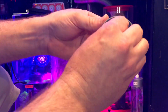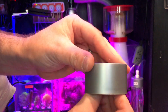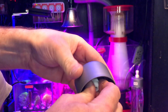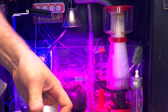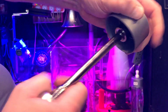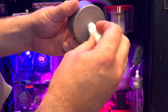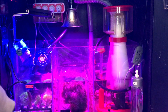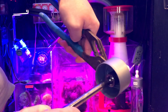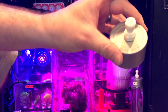I put the male end in here on the inside — it can be a little tricky; sometimes you have to work it in there because I didn't use the exact size drill bit. Then I use a 17mm socket to push it the rest of the way through. Take the female end and put it on the top. Make sure everything's tight, or else you're going to get air in your line, which means you won't be giving an accurate dose amount.